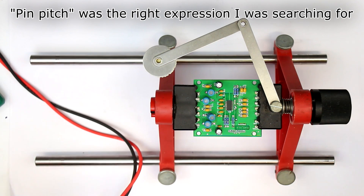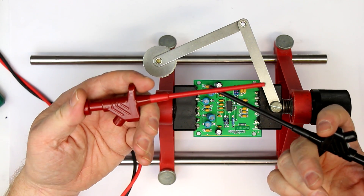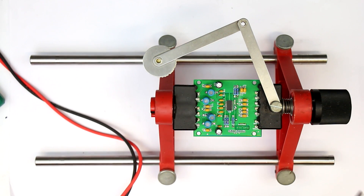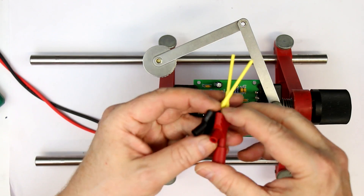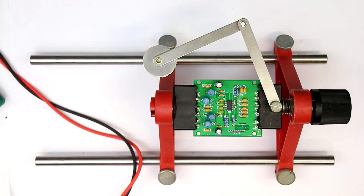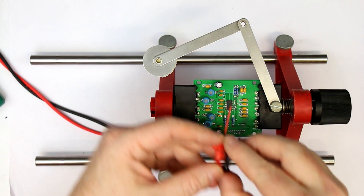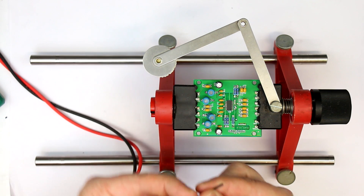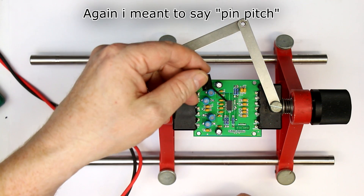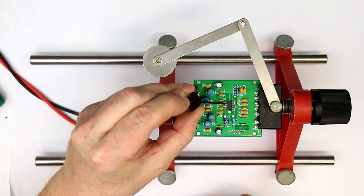The problem starts when you want to fix some grabbers. These ones here from Hirschmann were the standard in Germany in the 1970s and 80s. I always disliked them simply because they are too large and too heavy. There are also smaller ones here, although these are for two millimeter banana plugs and not four millimeter banana plugs. And even still smaller ones we will also put into our shop. You can get quite expensive ones for probing or holding two IC pins with a very short distance, but the risk is always that you are simply shorting out two IC pins lying side by side.